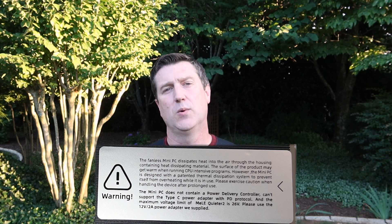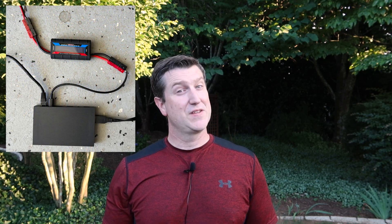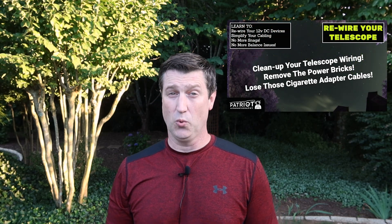It gets a little bit tricky when looking for a way to run this off a battery. So let me tell you what I did, which was to make my own power cable using a USB-C pigtail cable like this one here. Since I use Anderson PowerPole connectors for my equipment, I just terminated the ends with a PowerPole connector. The manufacturer told me the white cable is positive and the black was negative, so it was a pretty easy job. Powered it up, and everything works as expected. I'll try to remember to link it in the description.